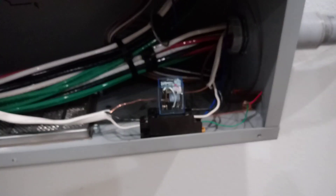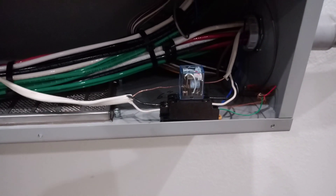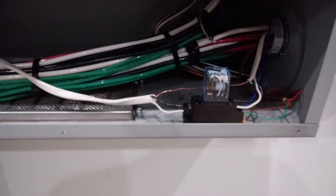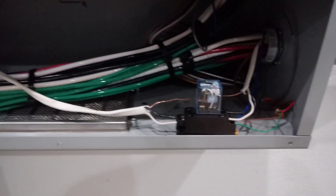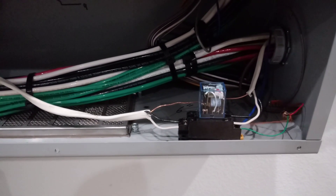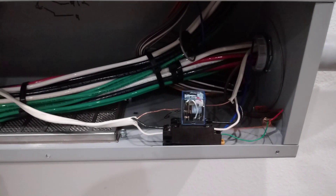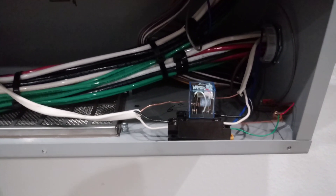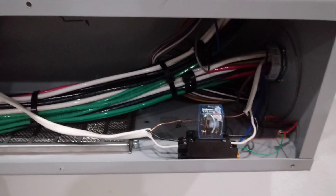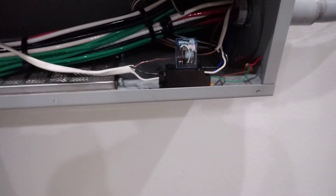The relay is going to send 240 volts from our protected load out to that ATS. Whenever we want the generator to turn on, it's going to drop that 240, which is what the ATS uses to decide whether to start or not, and it'll start the generator. When we want to turn it off, we'll turn off this relay, it will resume the 240 to the generator sense wire and shut down the generator. I've got it on normally closed so it just has to turn on to drop that 240.